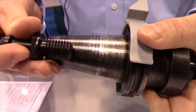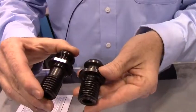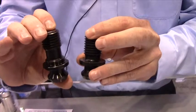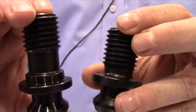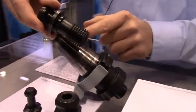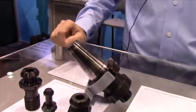We took two retention knobs with the exact same head dimensions. What we have done is place an undercut underneath the flange and place the threads into a deeper cross-section of the tool holder. What we're doing is placing the threads in a deeper section of the tool holder, causing the force to be pulled up here, preventing the tool holder from expanding.